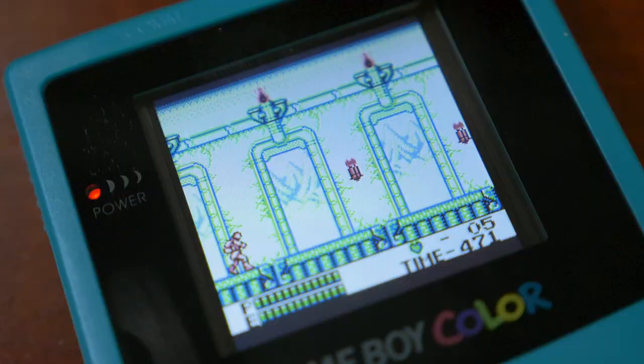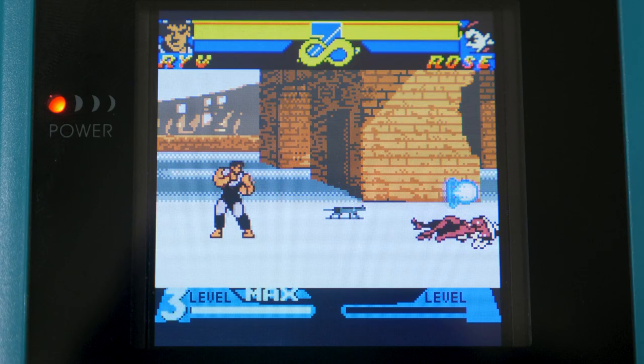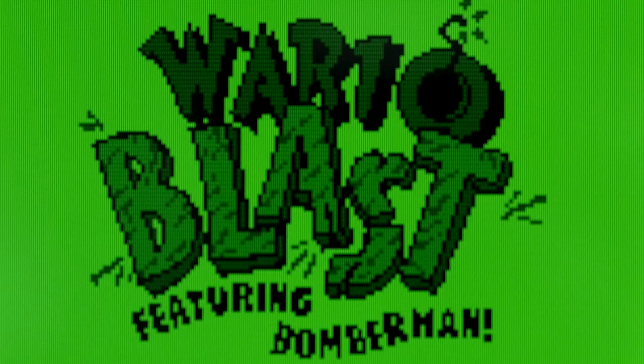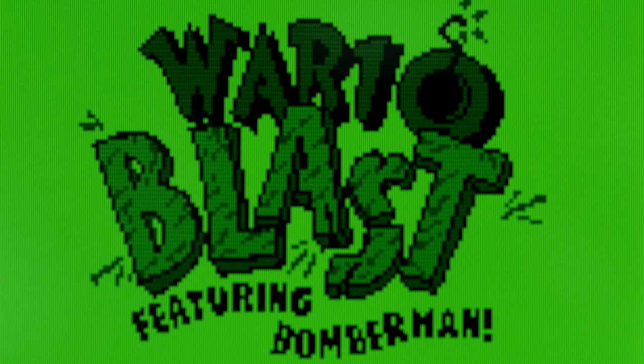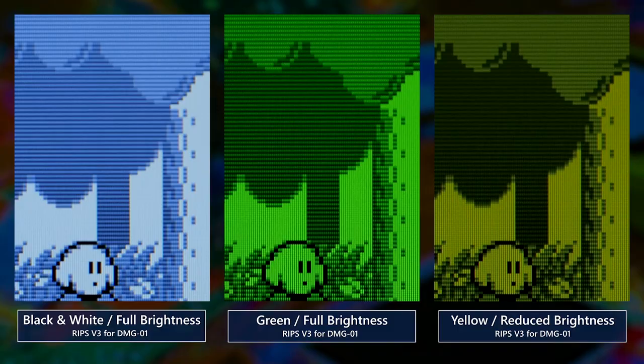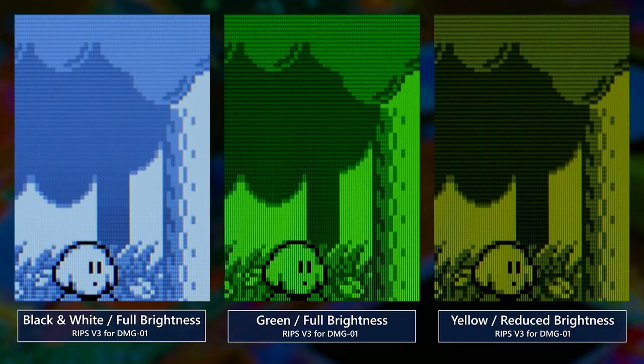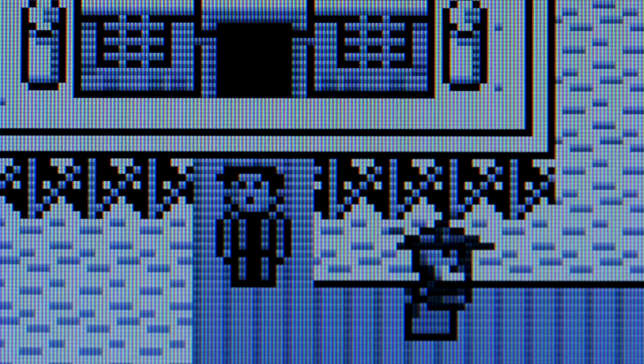This specific type of image retention seems to not occur on the Benven or McWill screens, which are TFT LCD panels rather than IPS. One more flicker observation: on the R-IPS V3 screen kit installed in the DMG Game Boy, the middle tones actually flicker constantly — stuff that isn't supposed to flicker, like regular sprites and backgrounds. It's more noticeable on certain palettes than others, and the effect does become less pronounced if you reduce the brightness. If I pause the clips, you can see there's a sort of scanline effect, flickering rapidly like interlaced video — similar to those AGS-101 screens with a similar effect, but it's a disappointing flaw.